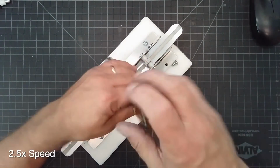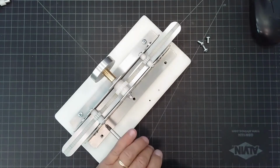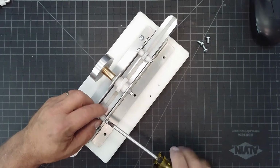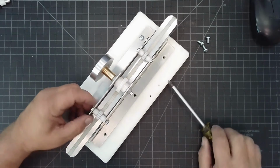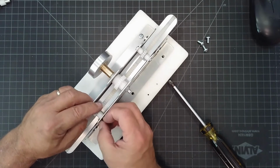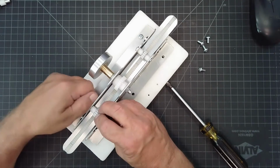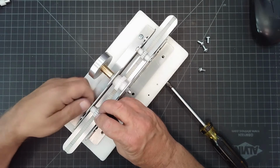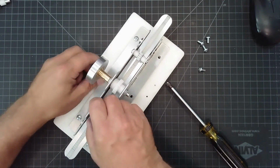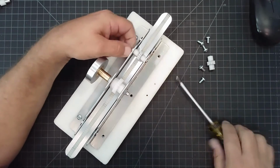3 screws for that. So what else holds us on here? These two pieces right here are kind of important. They're idlers, but they're important in setting the overall width of this assembly based on the shaft that's in here. So let's get rid of these. I did loosen some of the screws a little bit earlier just to make this quicker. And I know Josh is going to be able to edit this pretty well.